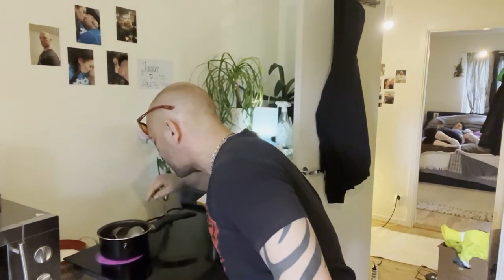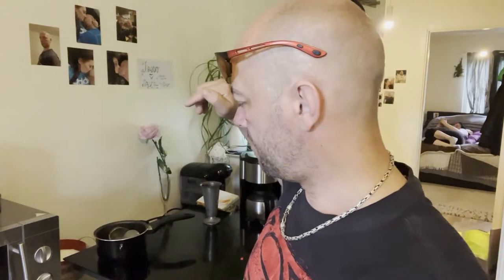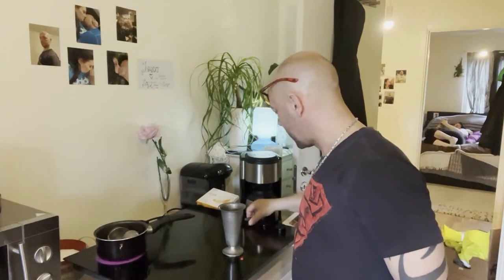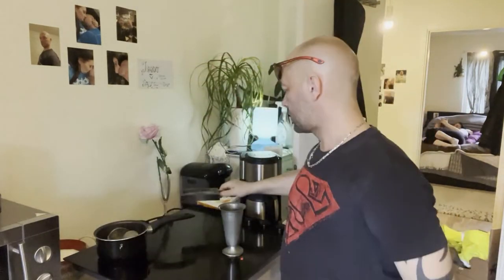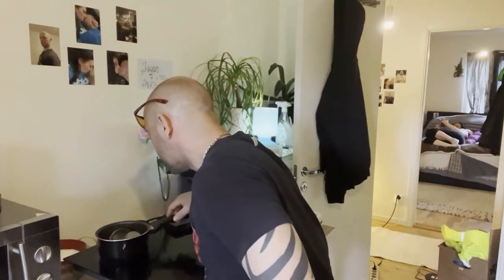I'll be back — it's started to melt now, at least the small pieces. I'm going to put the camera back on when I start pouring the mold. I've also started the other pan on really low heat, because you always want to preheat your mold before pouring — heat meeting cold is not a good combination. So I'm just keeping it at a low temperature to get the pan a little bit warm for the first pour, then it'll stay hot enough to continue.